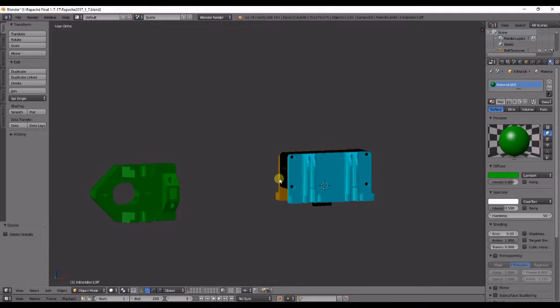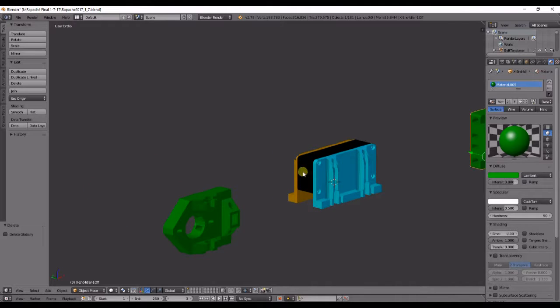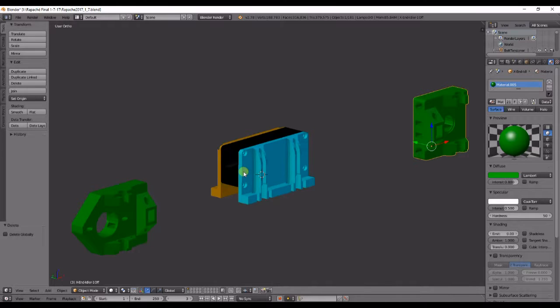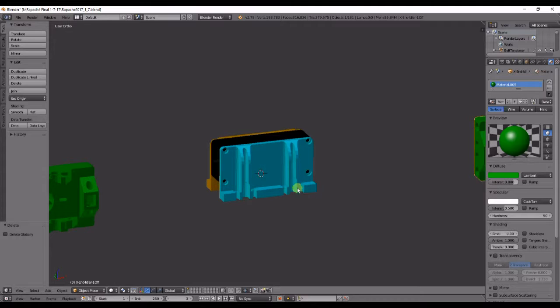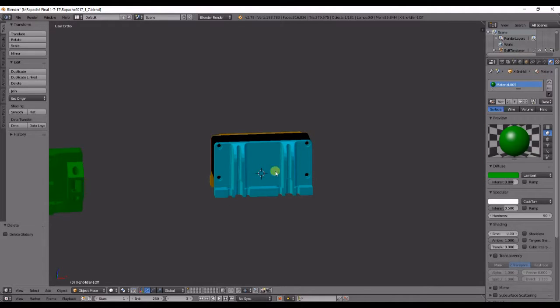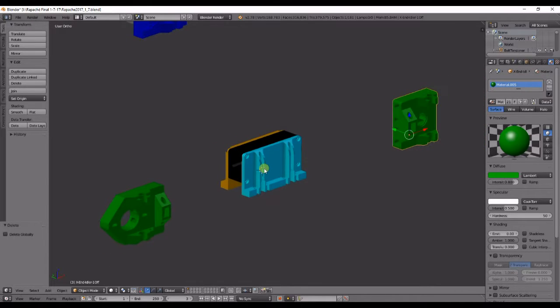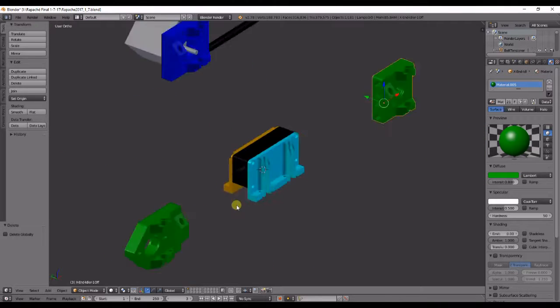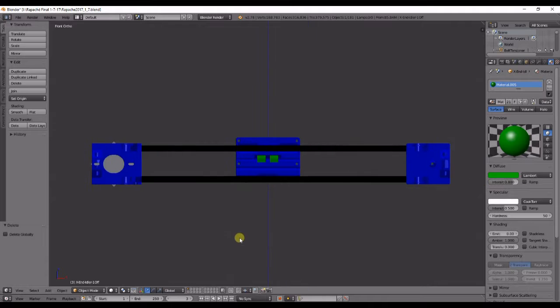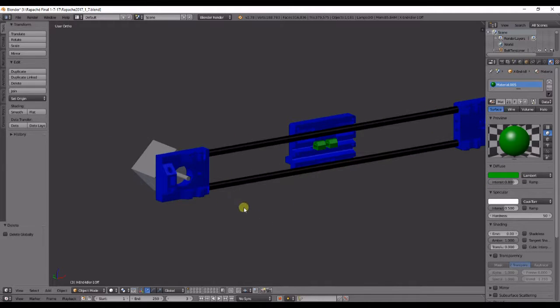And then I didn't like this design being in three different pieces, so I made a front and a back. I'm still not done with this because with the new Prusa Mendel i3 Mark II, it is being upgraded as a one nozzle system with at least up to four extruders, and so I can switch this around and remove about half of it later. Now this is going to change the internal dynamics of what I have remodeled this as, so I'll do a workaround when it comes time for that, but as it stands I'm going to go ahead and use the four mounting point system. So this is what I have up here as my final design right now.